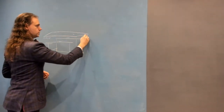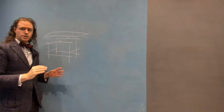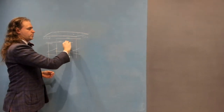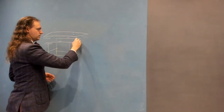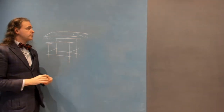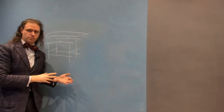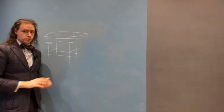This is the tail of the bench. The tail will also have another attachment on it, either straight onto the bench top or possibly a piece of wood between these two, carefully slotted. It's a very wide mortise and a narrow tenon that will then hold up the tail vise, which is going to be a full width vise made from scratch. Well, I bought some old wooden bench screws, because I'm not going to make my own bench screws. Other than that, from scratch.